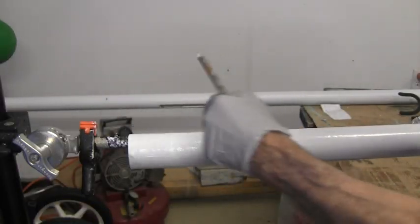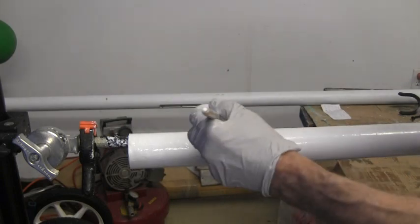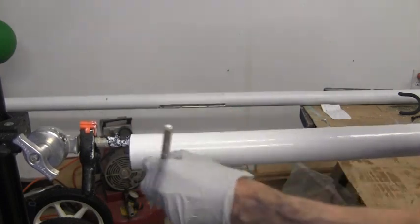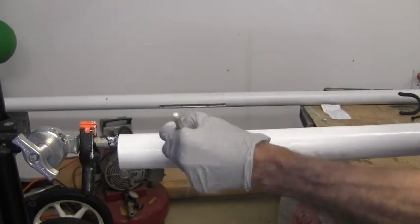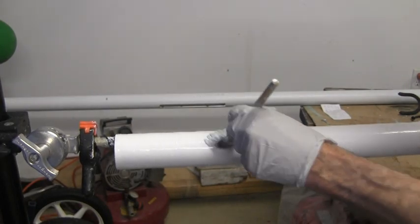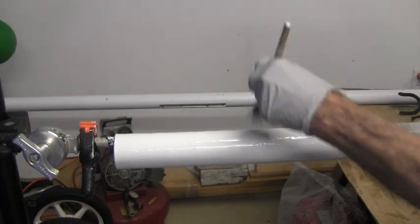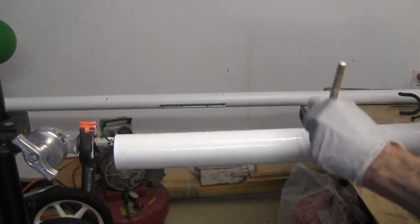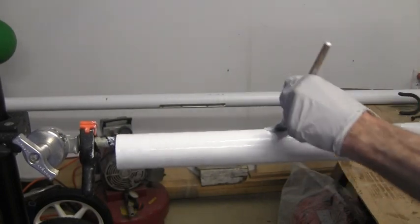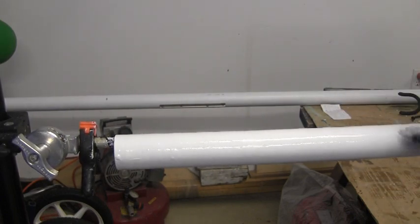When I put the very first coats on, I was going like this — lengthways. In the Coast Guard, they told us with old oil-based paint: put it on, take it off. So basically what I've been doing is I'll put it on and then run it, because I can twist my mast. I'll go around and corkscrew it, and I found that leaves almost no sags. So: put it on, take it off. Be careful when you're doing this that you're not spraying paint all over the place. And I get no saggy runs.